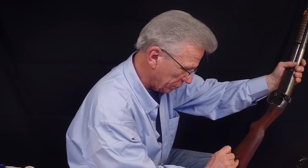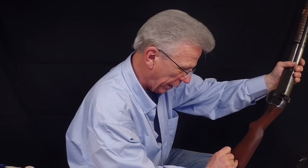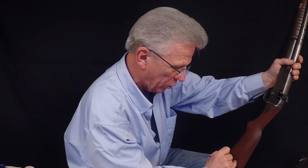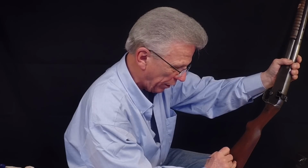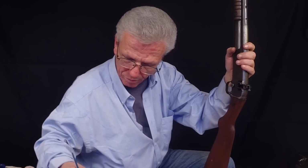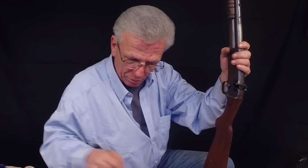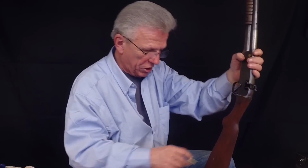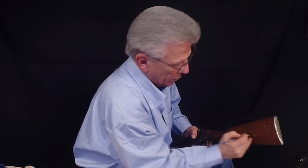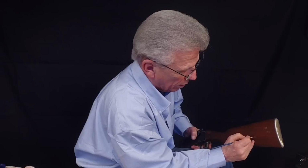Reload our brush. Again, with the grain. Always look to see which direction your grain pattern is going, and then go with it. When you're working with the putty, go in that direction. Wherever your grain pattern is heading, that's where you want to go with your brush. It takes just a couple of seconds to look at it, and you'll determine where it's going. And this one, you'll see the grain pattern is coming this way, so that's the direction that we're going to go.